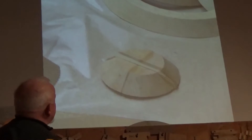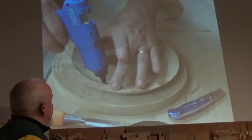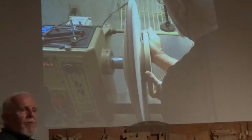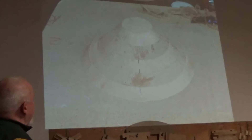I have a drum sander. Many of you might not have one, but if you have a disc sander you can still flatten them there. I put a couple of tacks of glue on the inside of that disc, mark the surface with a piece of chalk — if you don't have chalk in your shop you're missing out on one of the best tools. I hold it up to my 20-inch disc sander, and with my fingers well clear — I can't afford to lose any more — I'm able to flatten that surface. Then I stagger the joints, offsetting them 180 degrees.